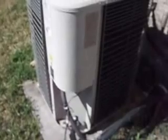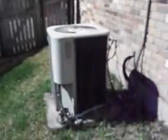Compressor unit on the exterior of the building, we're at the right elevation. The insulation on the cold pipes is in very poor condition and that needs replacing. There's signs of hail splatter on the unit, although I couldn't find any signs of hail damage on the roof, which is notoriously hard to find, but there wasn't any signs of it. Well, the unit is running okay, it's level. There's some hail damage on the fins, but that can be combed out.